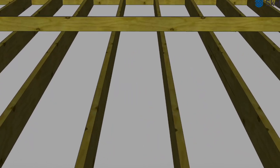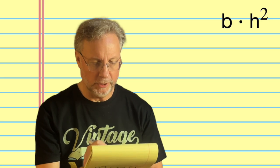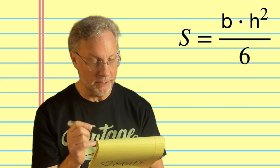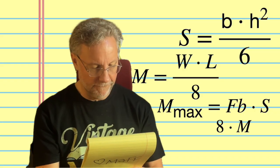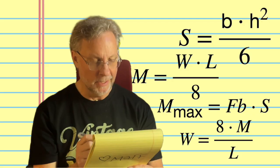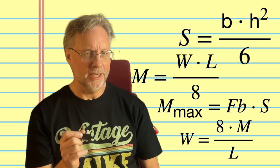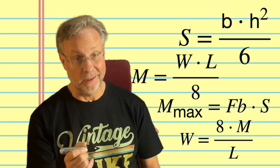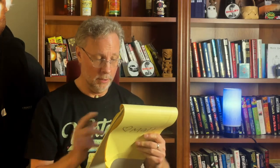I found all the formulas and lookup tables to calculate the max bend of one of my joists. My joists are southern pine 2x12s, 20 feet long, spanning 24 inches apart. First, determine the section modulus: joist width times joist height squared divided by 6. Then calculate the maximum bending moment: weight times length divided by 8. Get the bending capacity by taking the southern pine allowable bending stress and multiplying it by the section modulus. Convert to foot-pounds, then calculate the total load capacity. Since the joists are two feet apart, the load per square foot is 580 at mid-span. I also discovered what a strong back is — I thought that board running across my joist was just to carry the gas pipe, but it actually distributes the weight. Adjusting for distributed load, and the result is...